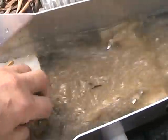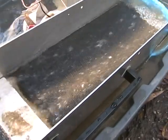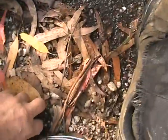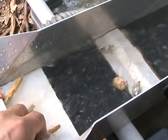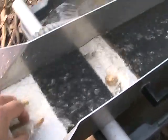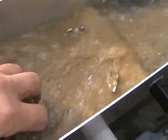So here we go — run it down. I don't mind using the fingers; it helps you spread it a little bit more evenly. As you can see it's not a bad flow — it's a little bit to one side but I'm not going to lose sleep over that. Now just to show you here, let's find an obstruction. The wing nuts can also contribute to changing things. We've got a rock there — let's see if I can't move it by changing the pegs. There's movement but we haven't quite moved it on. That's the purpose of these little pegs: if you've got a big build-up of gravel in the centre you can just move the pegs and it'll move them on.